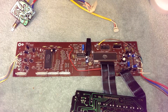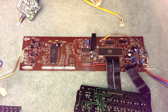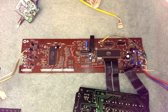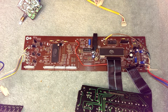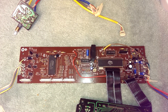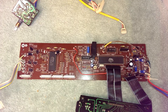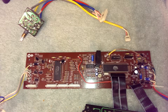Despite the lack of sophistication on the amplifier board, it made me think maybe this thing is older. It has to have an external drive circuit — I thought it was more integrated than that. I thought we had a really nice preamp on the same board, but there's no preamp on that board — it's all power amp. It's just a power amp and a drive stage for the power amp. And that made me think maybe this is older than I think. But then again, I see that super cap and I'm back to my mid-80s theory.